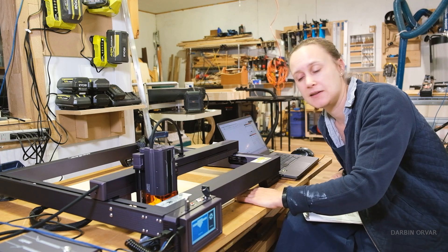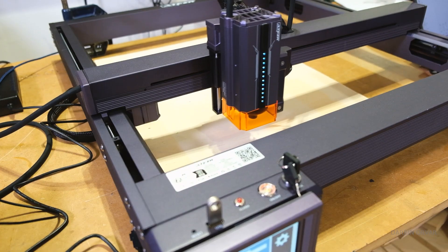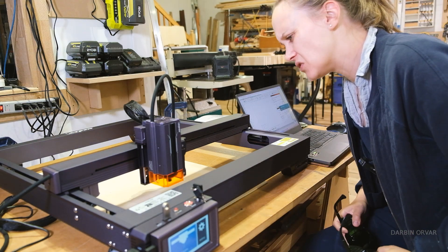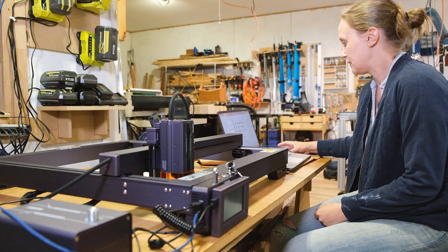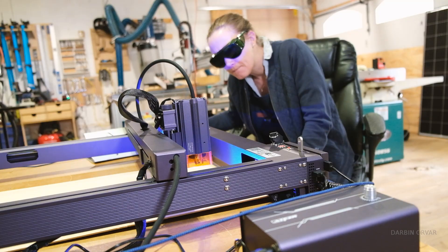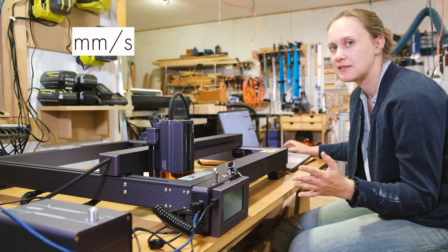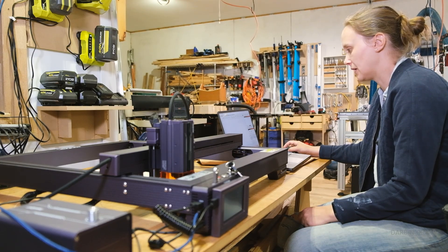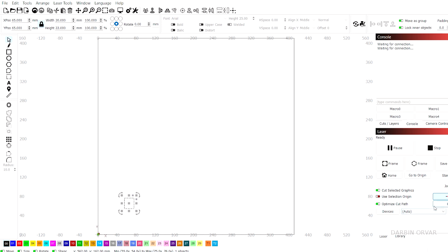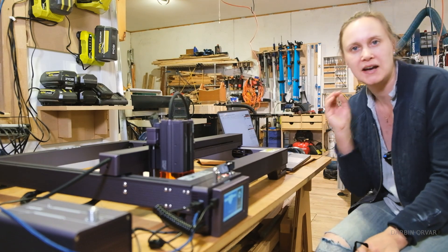Under here I now have a thin piece of plywood. Let's hit start. That didn't actually do anything. Yesterday when I was playing around with this, I wasn't able to get it to work and I think my main issue was that I just had my speed set too quickly. I was testing between 300 to 3000 speeds. I did a test at 30 and that seems to be working better. My issue all along was just that I had things way too high — by a magnitude of 10 or 100.